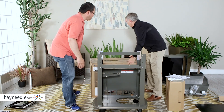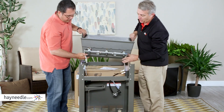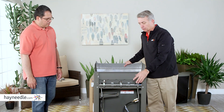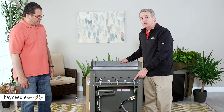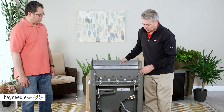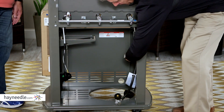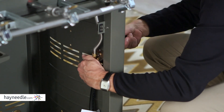The next step is to lift the cook box up onto the grill. Make sure you drop the gas line and the igniter behind the bar so it sits down inside the grill. All the burners and valves are pre-assembled into the cook box. This is our cast aluminum cook box — it will never rust. Everything's pre-tested at the factory. The first thing we're going to do is mount the bulkhead, which is basically the gas hose, on the side using parts from packet B.